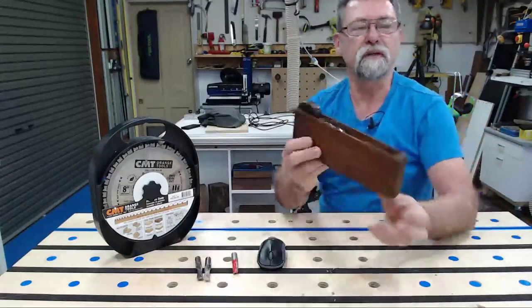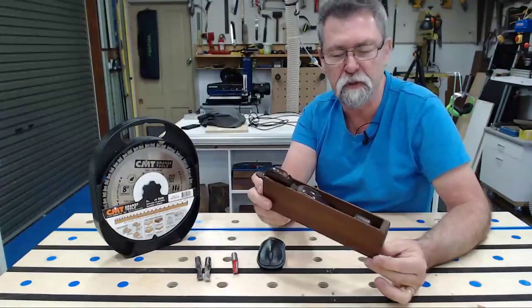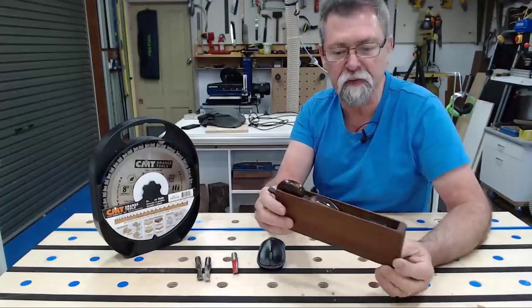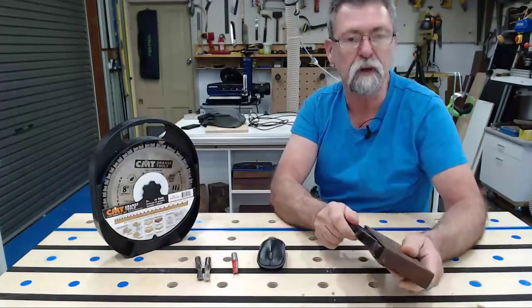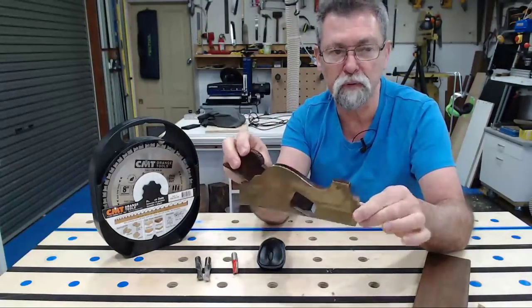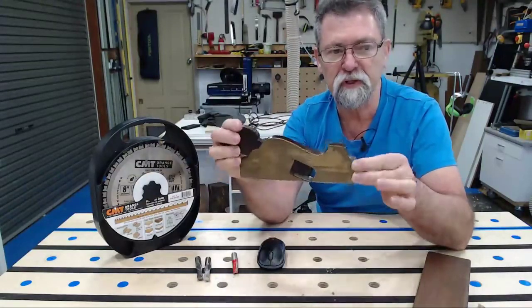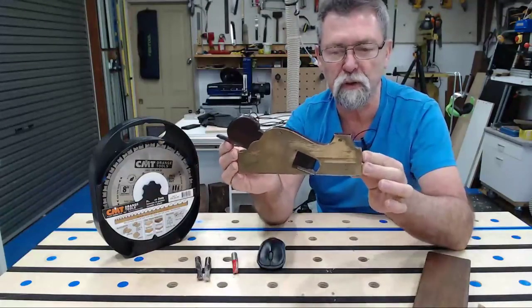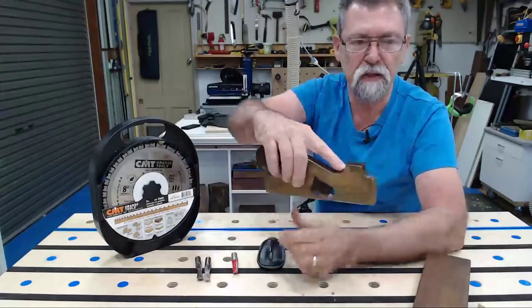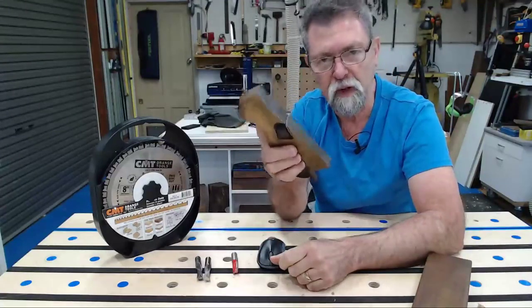now I'm also going to show you this guy. Now, this is for people that have been watching my channel for a long time. They'll realize I did a series, 30 videos of what's in Arthur's toolbox. And Arthur was my great grandfather, who was a cabinet maker and also a carriage builder for the New South Wales Railways. And I inherited absolutely all of his tools. And this is one of the shoulder planes. This is a 3/4 inch shoulder plane. And it's very similar to what you would call a Norris shoulder plane, except the Norris has a bump out the front, not a rebate there. And this is designed to clean the bottom of a Dado or a rebate across grain.